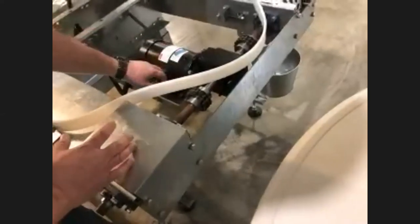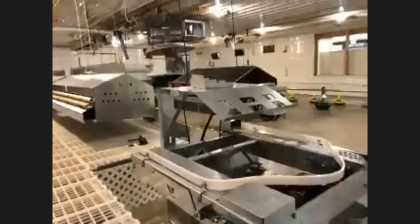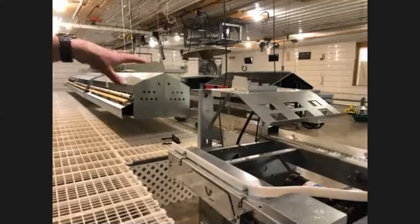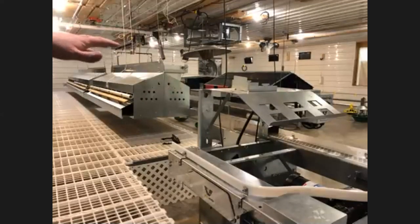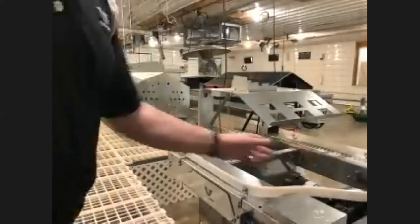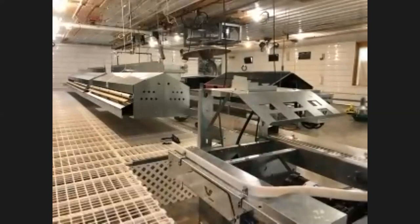Question: if somebody has fabric belts now, can they switch to poly belts? Normally with a woven fabric belt, no one would use the belt take-up system — but if you put in a poly belt, you must have that take-up system because the belt flexes so much. When you do that, you will need to pull the table away from the wall enough to get the belt take-up system in there — about 18 inches. So you're using everything the same, you just move the table and add the take-up system to switch to poly belt from fabric.